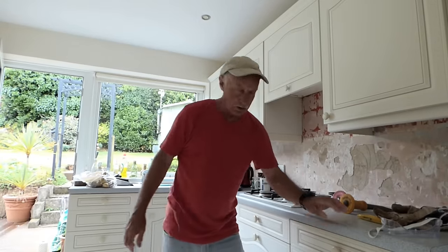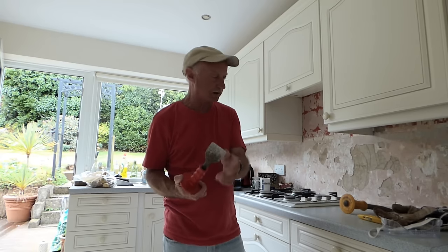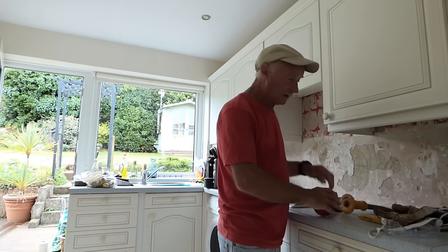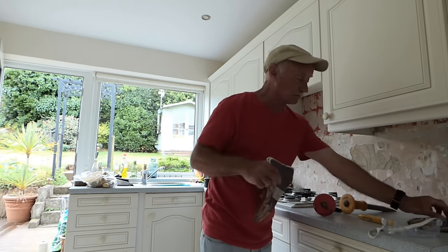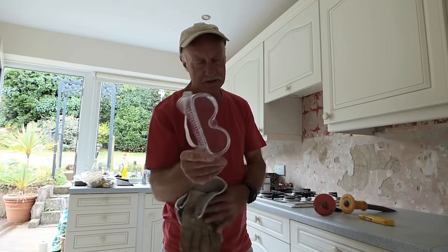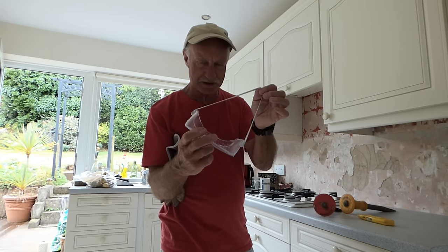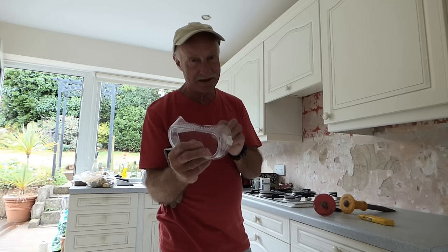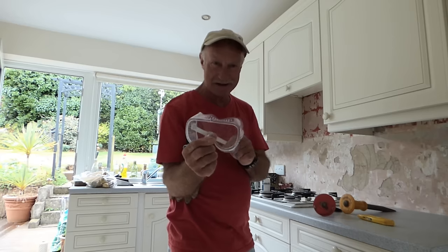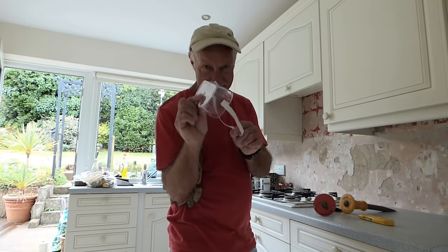There are lots of tools different people like to use. I like the good old bolster for getting the tiles off — a nice sharp one to get down behind the back of the tile and knock it off. I like to wear gloves; it seems to make the hammering easier. And also a must are eye goggles — absolutely got to have these. Don't go knocking tiles without them. If you get a sharp piece of tile in your eye, I promise you, you will never want to not wear these again. It happened to me years and years ago, back in the early days. Ever since, I always wear these goggles.